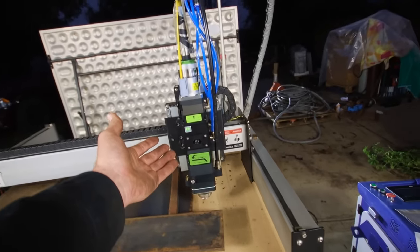It turns out that using about half the power of a laser and half the power of oxygen, you can cut through pretty much anything. This is a new laser head — the old one exploded. We made our cut inside of Lightburn, and thank you Lightburn for the free license. If you want some free user experience input in exchange, I would gladly give it to you because there's a couple of things in the software that don't make any sense. Three-eighth inch steel plate, 2,000 watts of laser power.